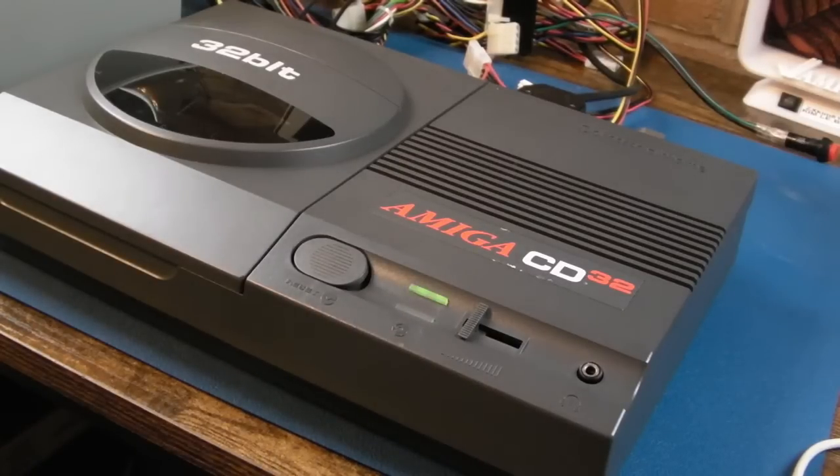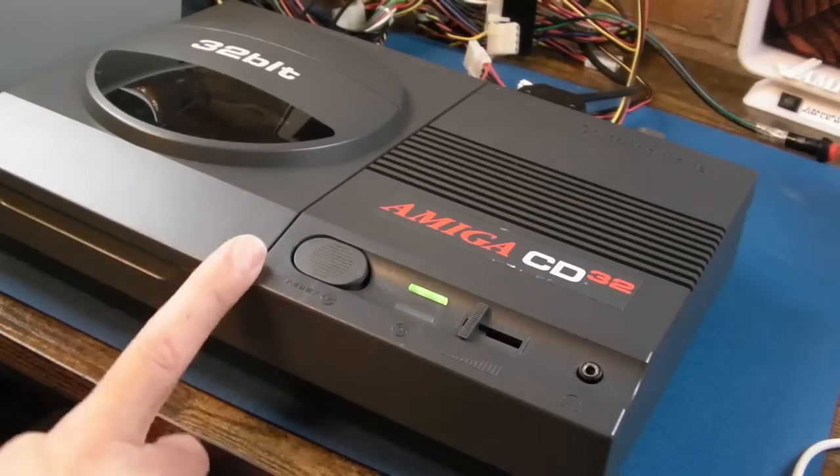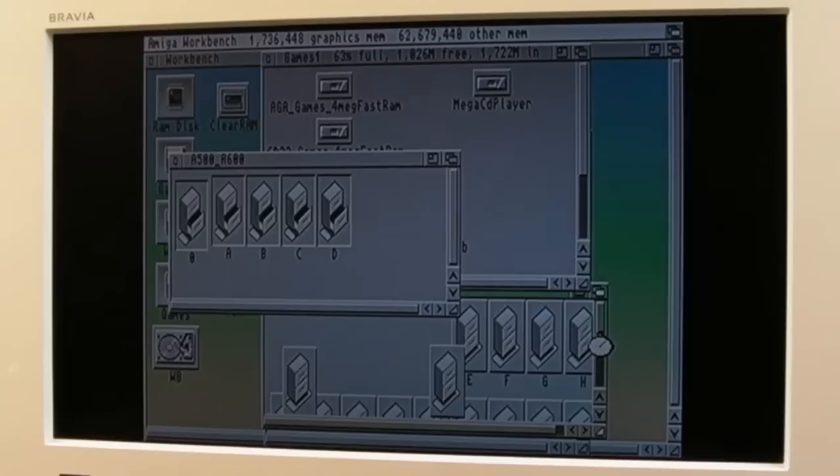It's so stable now, it's so robust, and I do have voltage drop still, so it's interesting as well that these will run even at 4.7 volts. It's quite happy, which I find amazing actually. It's amazing that the chipset on these is quite tolerant at around 4.7 volts. And I've been using this for a few days now. It's absolutely solid. So yeah, it did need the recap, but the instabilities that kind of prompted me to do this, the glitching, which I'm not sure I captured, and then it may freeze or reset. Yeah, and it was that crystal. It was just that crystal.